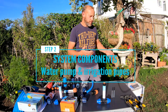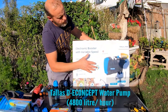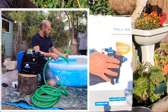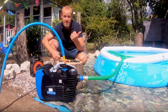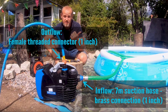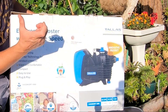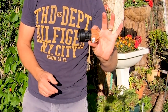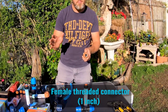Starting from the pump — my pump is actually plugged in so I'll use the box here for illustration. You've got your inlet where water is sucked up through a suction hose; these are one-inch connectors on my particular pump. You want to make sure your inflow is always bigger or the same size as your outflow, otherwise your pump is going to work really hard to suck not very much water. At the top end there's a male fitting, one inch, and from there I'd use something like this — a female adapter, one inch, with a compression fitting that connects to whatever size pipe I'm using.